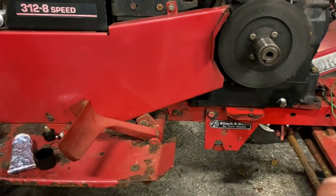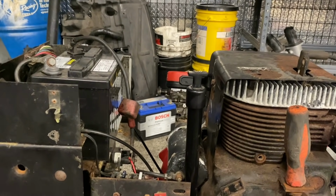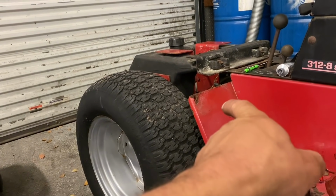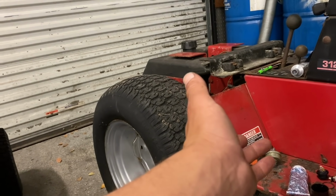Okay guys, so the oil is changed now. Got the drain plug back in with some RTV on her, put some new oil in, and put the dipstick back in there. And now we're gonna go ahead and mess with our seat here. We're gonna take the fabric off of our seat, and then we're gonna place it back up there onto our newly exposed chassis up there, so that we can, you know, just not have fenders. I'll just put something else on there later on.